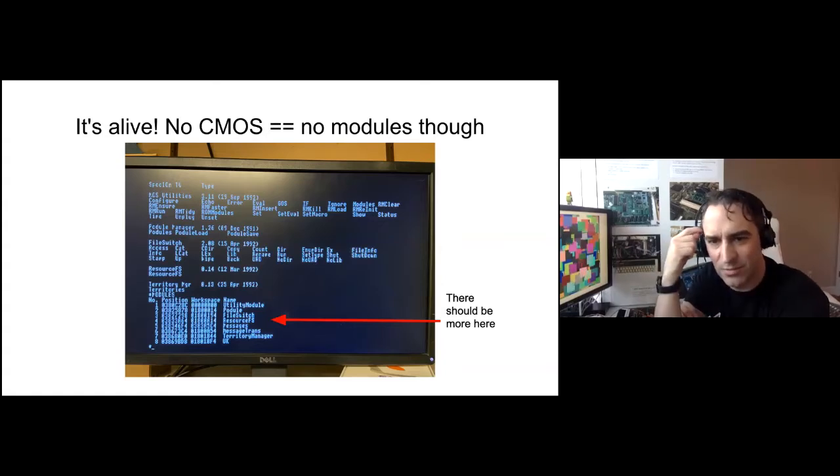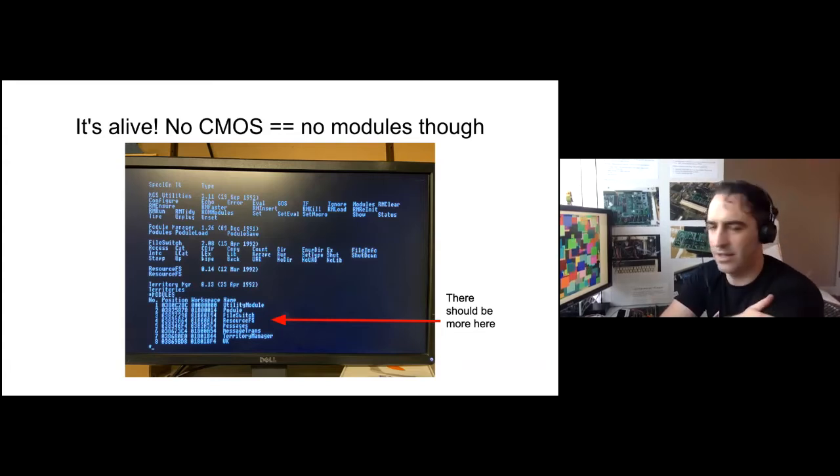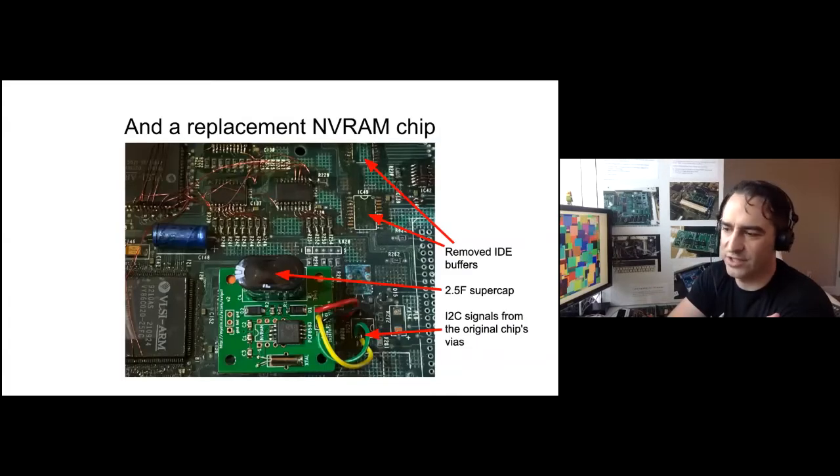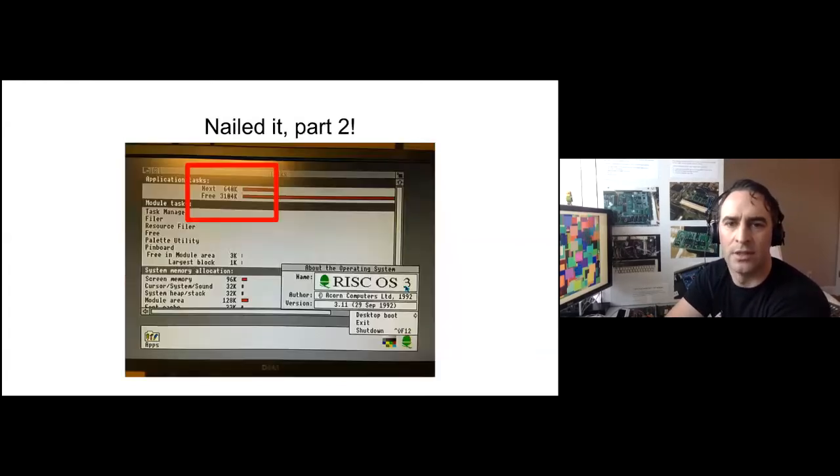I spent some time looking at the RISC OS code for the MEMC test and realized my mismatched set of RAM chips was perhaps the cause. I had two 4-megabit chips and six 1-megabit chips. The 4-meg chips would be respecting the RA9 pin and the 1-meg chips wouldn't, so they'd be aliasing at different addresses. So I got those six chips off. You can actually remove RAM chips from a SIM quite nicely by just sticking it on a hot plate and turning it up for a while. I got all those chips off and soldered six new ones on. I also fitted a new clock chip — one of my boards with a supercap, soldered onto the vias for power and ground, sitting on top of the FPA11 socket. Four megabytes, and it boots cleanly. That was really cool.